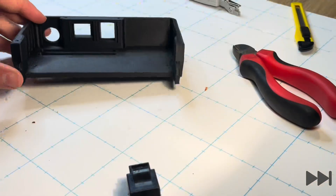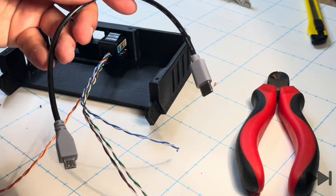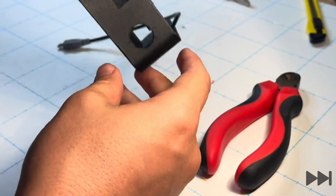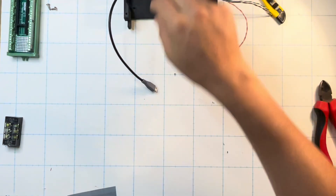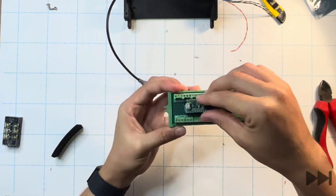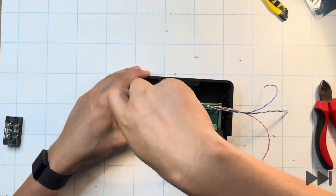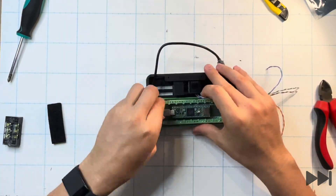We retrieve the J1 electronics tray and press-fit the Cat6 keystone jack into the right hand side hole on the back when viewing from the front. We do the same with the USB-C keystone jack, pressing it in so it's flush with the front of the electronics tray. We then take the Teensy microcontroller, mount it into the Teensy breakout board with the smaller numbers pointing left, install it with the USB plug oriented to the left, screw the breakout board into the electronics tray using two number six thread screws, and neatly route the USB-C cable into the keystone jack.